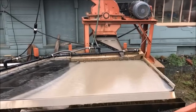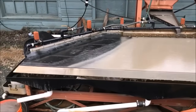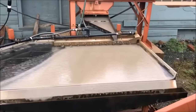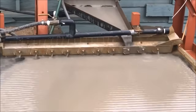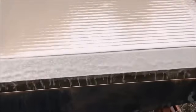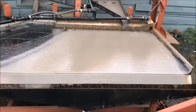This is a great shot of our shaker table showing the separation of the quartz and the denser sulfides right at the bottom of the ramp that we've built into the shaker table. You can see this really nice clear line where the quartz stops at the bottom of that ramp and is almost all flowing down into the tailings. The distributor trough is tuned so that the ports are evenly feeding across the entire shaker table surface — there is a nice even flow over the grooves, no rivers or rapids on the tabletop. You really don't want any areas on the shaker table that have a higher flow than other areas.